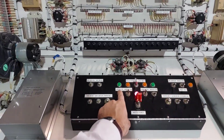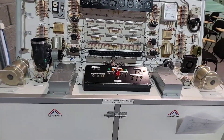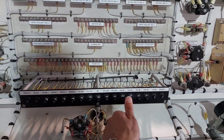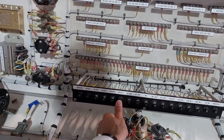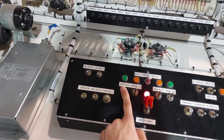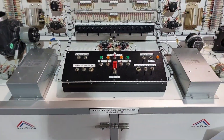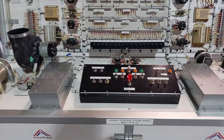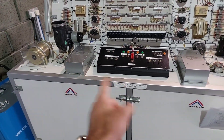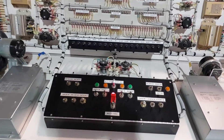Step three is the inverters. In the aircraft, inverters convert DC to AC for passengers using screens and USB outlets. To start them, push in inverter number one and inverter number two on the circuit breaker, then flip their switches up. Green lights should illuminate on your simulator to show the inverters are on — in mine they don't because I'm not using a battery. There is no other functionality to the inverters beyond this.